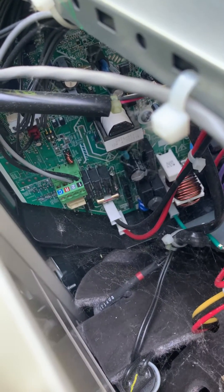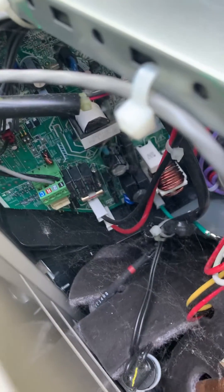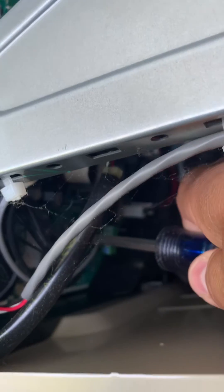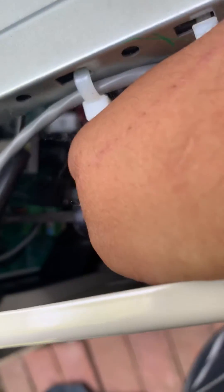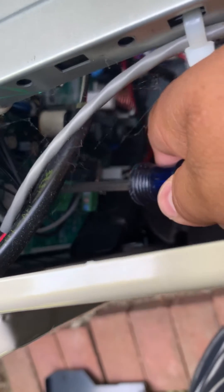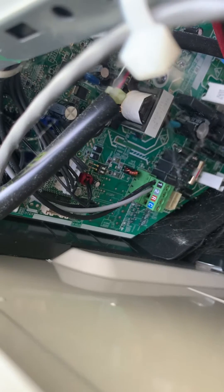So what I'm going to do is go ahead and switch that over. Make sure the power is off and you can just go in and set those dip switches — you're going to want to change both positions. So if they're both on, turn them off, or if they're both off, turn them on. And if you see in there now, we're in the off position on both of them.